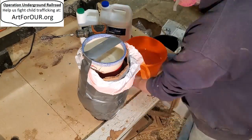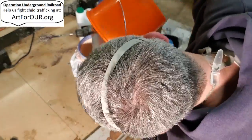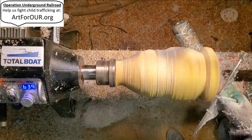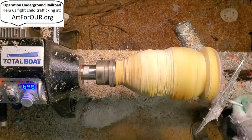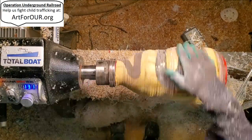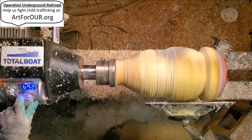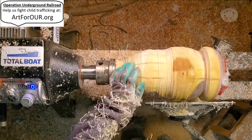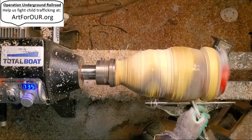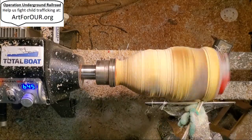I like to take big risks, and I've been trying to decide what's more important: the pressure pot, the thick set, deep set epoxy that takes a long time to set, so maybe the bubbles would rise, and or sealing the wood. So on this one, I only did the epoxy. No sealing the wood, no pressure pot. I just wanted to see what would happen. And big fat surprise, there's bubbles everywhere.